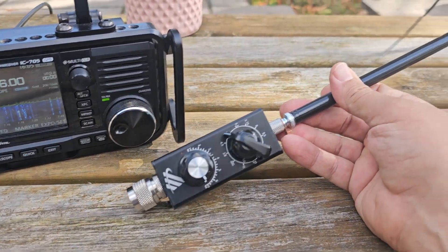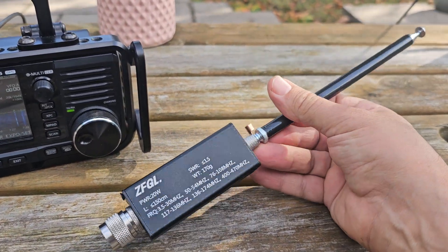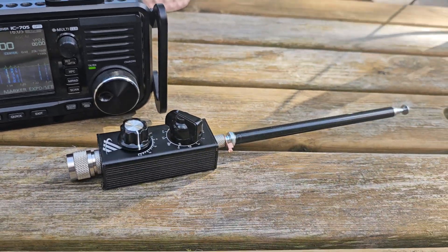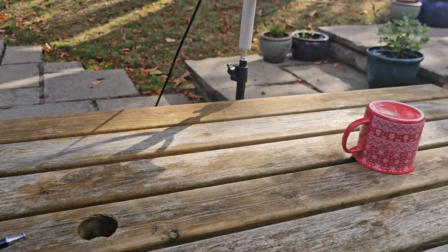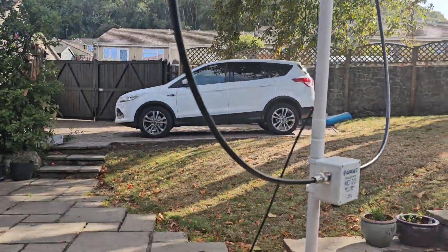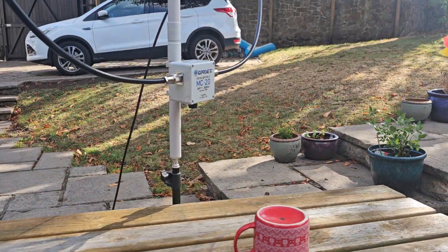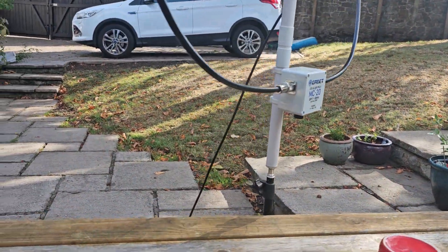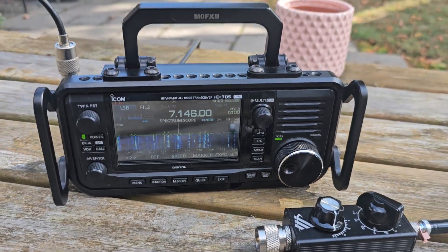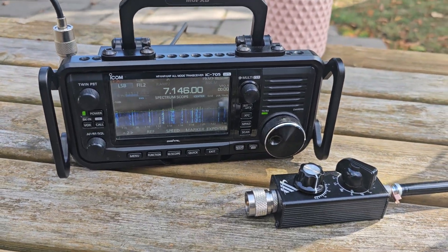These kind of telescopic antennas, I feel like they're just toys. You're better off, in my opinion, just cutting a length of garden wire. Now, a well-made loop like this is not a toy — you don't want to stand in front of that when you're transmitting. That's a proper piece of engineering. You can buy long vertical antennas, but they tend to be very expensive on 20 and 40.